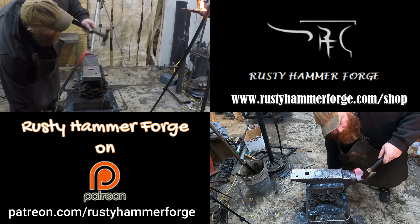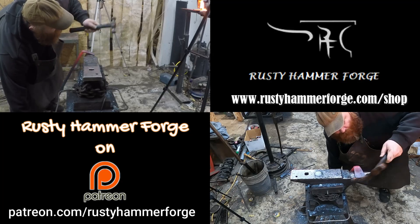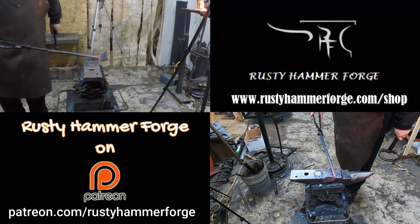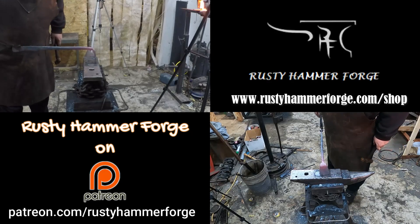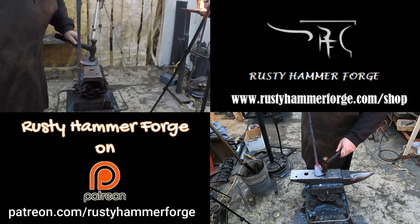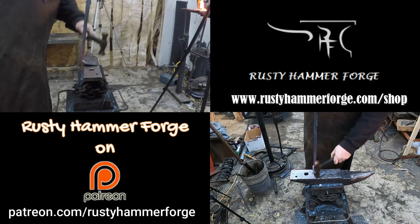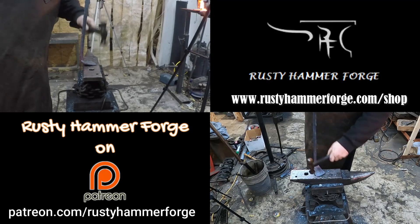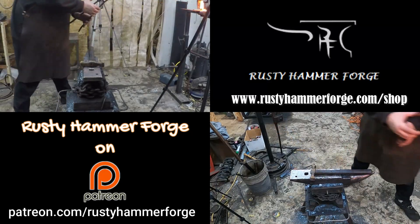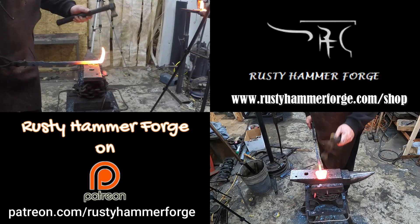That's what I want to make, so I'm going to kind of cut this a little bit so we get a little more chopping power down on that beveled edge — not a lot, because you still need to be able to come in and dig with it. That's another reason why it's a little longer, so you can get a two-handed scraper action on it. This would also be a good wood scraper for scraping tables or taking off finish. But ultimately, we're making an entrenching tool — that's what it's going to turn into.